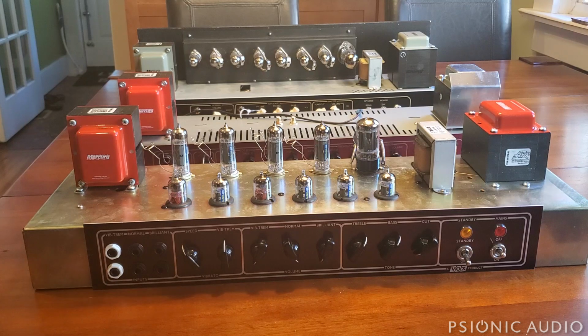The only one I would steer people away from, unless you really, really want the EF86 channel, is the Heritage series. I guess that's about 10 years ago, before they came out with the hand wired. The Heritage series use fake turret boards. So they have turrets that all the components are mounted on, but those turrets are soldered to little thin pads on the bottom of the PCB board. And it's a lot of mechanical stress on a very small solder joint on a very thin flexible board. And I have found that those things like to fail. So I would avoid those unless you just have to have the EF86.